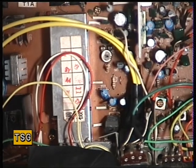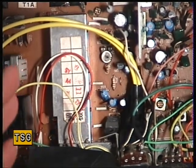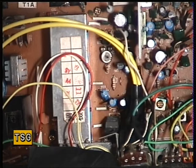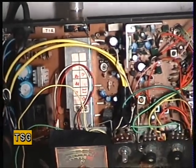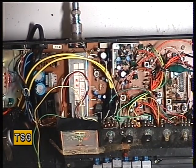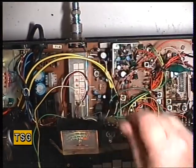So there you have it - some very difficult to get to controls; needs taking the board out if you need to get to those. But thank goodness it's got the LC7137, so it's actually easy to set up the synthesizer. I was fearing we'd got to have a big faff around with a three-crystal mixer arrangement. So next video we'll cover the receiver, which luckily we can get to all of that.